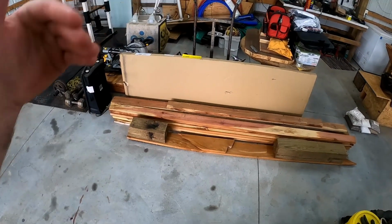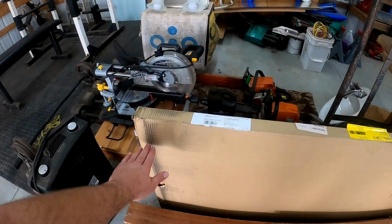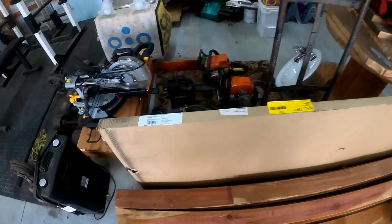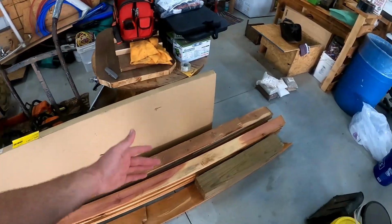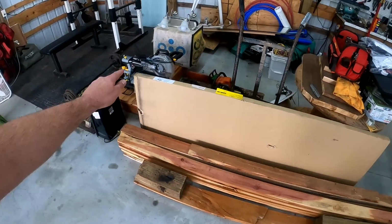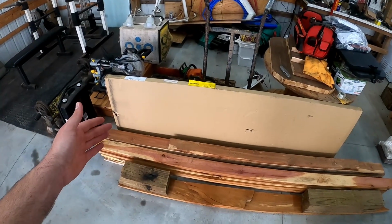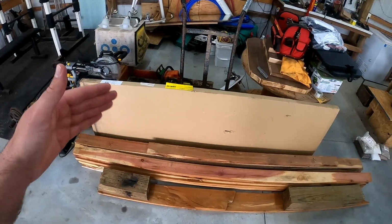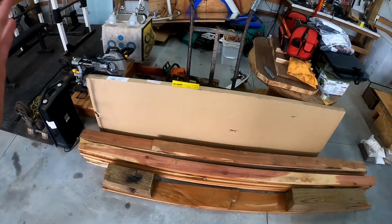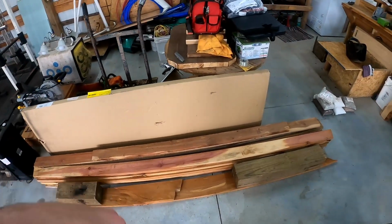25 inches is actually going to be too far out for the door. So I'm going to rip cut 3 inches and create kind of a backsplash on it. But the first thing I need to do is create a frame that goes under this. And we're going to do that with some 2x4s or 2x6s and just build a nice little frame to go under that. And that's going to be our starting point. And then I'll pick up the design and stuff like that from there.